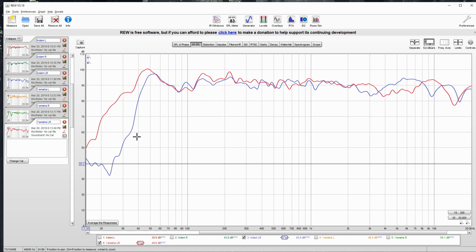This should be a pretty good side-by-side comparison of the frequency response in this particular room, with this particular setup. So we can compare and contrast here a little bit. Definitely the Yamahas reach down further, since they are 8-inch drivers, not 7-inch like the A7X. So I would expect the Yamahas to be more responsive in the low frequencies. They both excite this 40 to 50 hertz node of the room. But the Yamaha HS80M definitely have more bass down to lower frequencies. Not really a huge surprise, since we're pitting a larger enclosure with a larger driver in the Yamahas. So I would expect that.